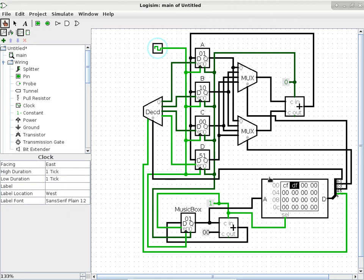So we built everything from transistors to NAND2s and then to OR and NOT, and then we talked about the other gates, the adder, the subtractor, and then the flip-flops, the SR latch, and then memories and stuff like that. We even looked at the decoder in terms of gates. So we're building things from the bottom up. All right, any questions? I like that way. Some people like that, some people like the top-down way a little better. But the bottom-up way, I think, is easier in a class like this.